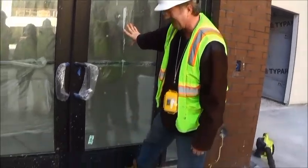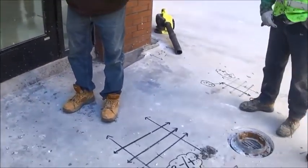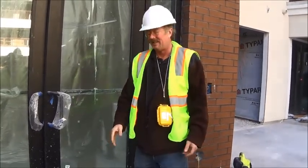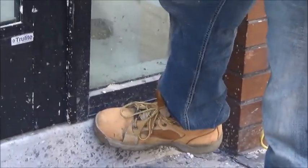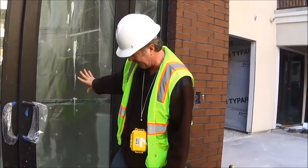Remember, if your finished tray is going to be right here, all that water is going to want to hit the door. And I can tell there's a pretty good slope here. Just because there's a slope on the concrete deck doesn't mean you're going to create a proper slope up here. For all we know, if you go on this one, okay? So the deck's fine for us. So now, right here, no waterproofing. So the chances are they might just want to caulk this. We don't know. Do they want our waterproofing to stop here? Do they have another design, another membrane for the threshold? Is it Dow sealants coming in, you know? So we need to ask questions there. It's not a hard fix. Even if we stop the hot rubber up here, it's still not a hard fix.